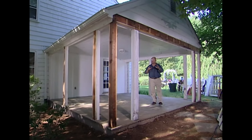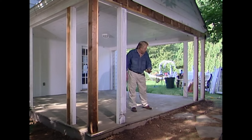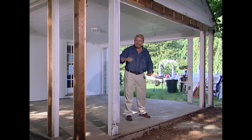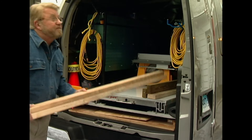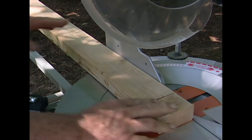While I'm finished with the destruction, now I want to start the construction. I want to begin by putting a short wall between the posts, about three feet high, because everything from there up is going to be windows. I grab a few two-by-fours out of my truck for the sill and bottom plates, then cut them to length so they'll fit between the posts.